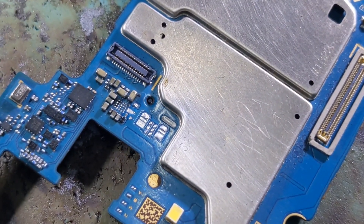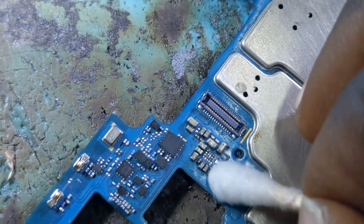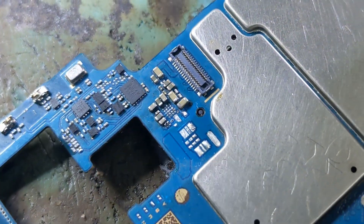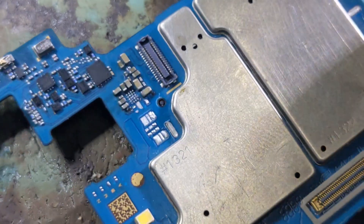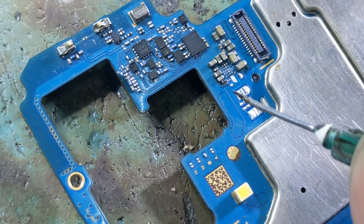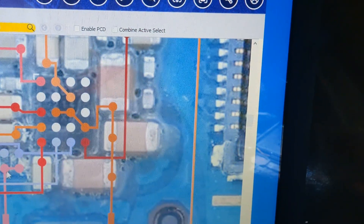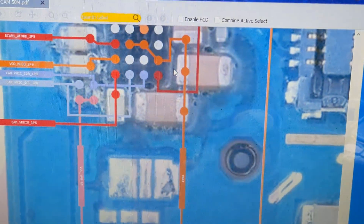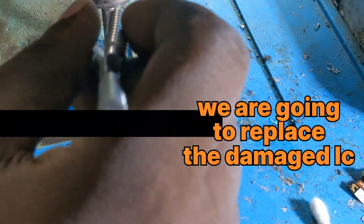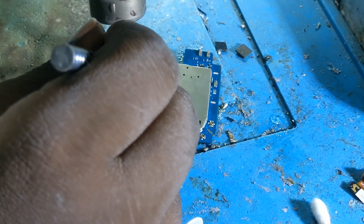By rejoining the line from the battery, the camera will work. The problem is the missing voltage — the current from the battery is not available, which is why this phone is not taking photos or videos. This line must be connected, but right now it is disconnected. Let's change the IC.